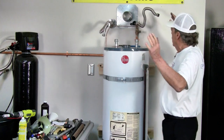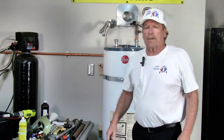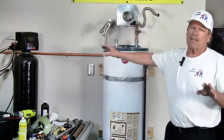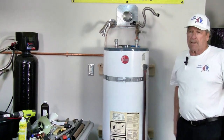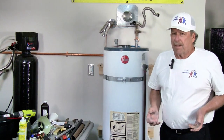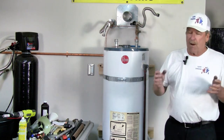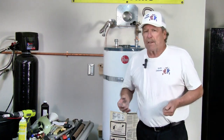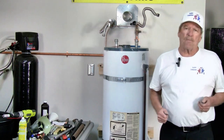You're going to come back, reconnect your connectors, turn the pressure back on, go in the house, bleed any air displacement out of a hot tap, then turn the electric heater back on, or for gas, re-fire it up. Happy to have you here. I want you to save yours, so I'm glad you're watching these video presentations. Come back and see us again — we love your comments. Look out for more presentations because I've got a lot more stuff coming. Thank you.